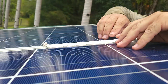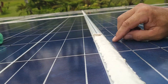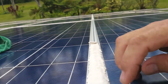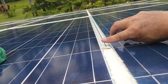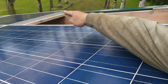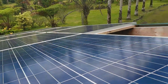This thing has been up and sealed for about three to four weeks straight with no leaks at all using the butyl tape method. If you look down the seam, there's a hump right here that helps shed the water. With this shield on the sides, it's just impossible for it to leak. You can see how sticky this stuff is — it sticks to the solar glass really easily. I'll put another piece under that and fold it over the top as we go. One panel left to go.